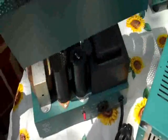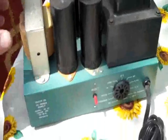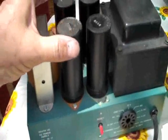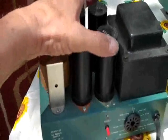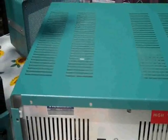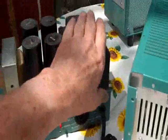Let's take the top off of this power supply and give you an idea what's underneath it. What we have here are two very large transformers — one being the power transformer. These four capacitors are 125 microfarads rated at 450 volts. I'll be replacing them with four 100 microfarad 450-volt capacitors, which should work just fine. This is a very heavy unit — this little power supply weighs more than this entire radio. I think the radio weighs about eight and a half pounds, but this thing weighs much more than that, because of this large transformer.